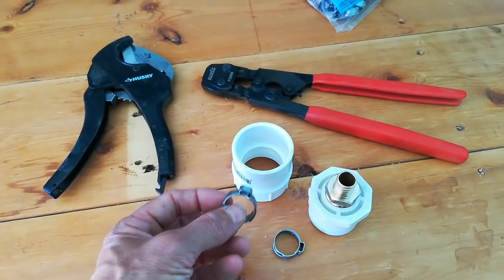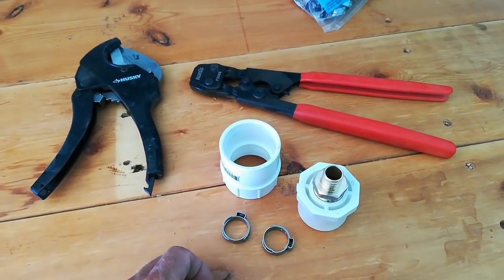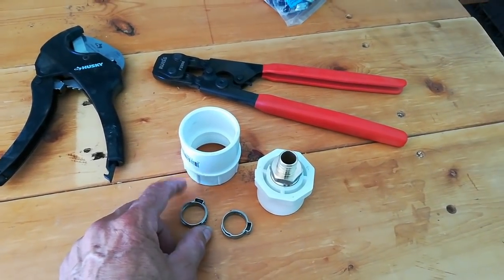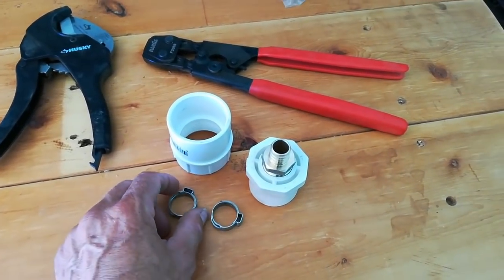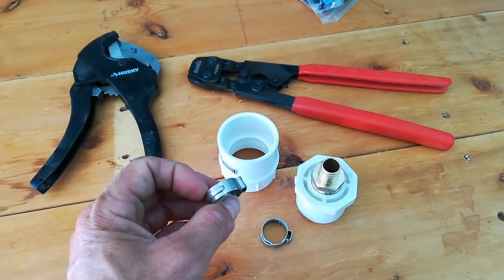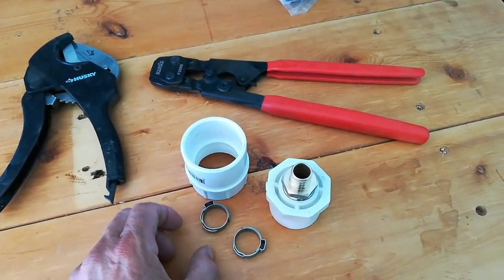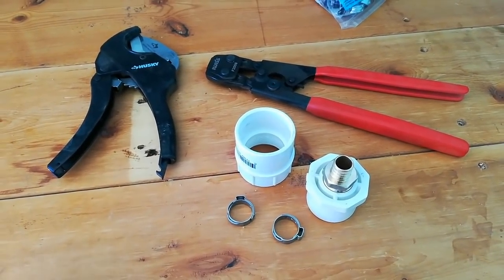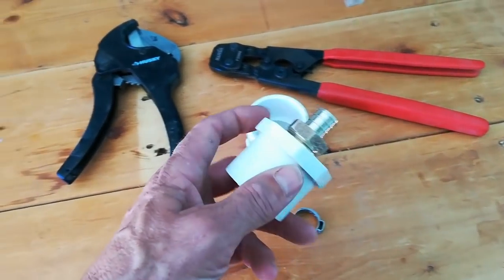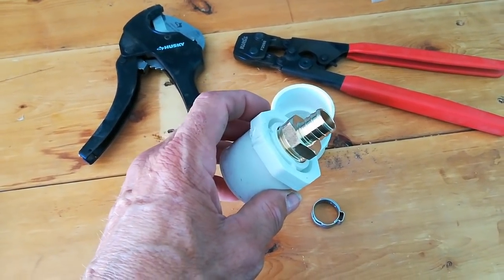These fasteners are stainless steel and more expensive than the copper crimp rings. However, the pinch tool itself is smaller and less expensive — the crimp tool, if you buy a good one, runs around $60 or $70; this one was $20. The rings are a little more expensive, but the good point is you can remove these without a special tool — just cut the tab and pry it up with needle nose pliers. With crimp rings, you need a special tool to remove them, which matters when you want to recover your brass fittings.